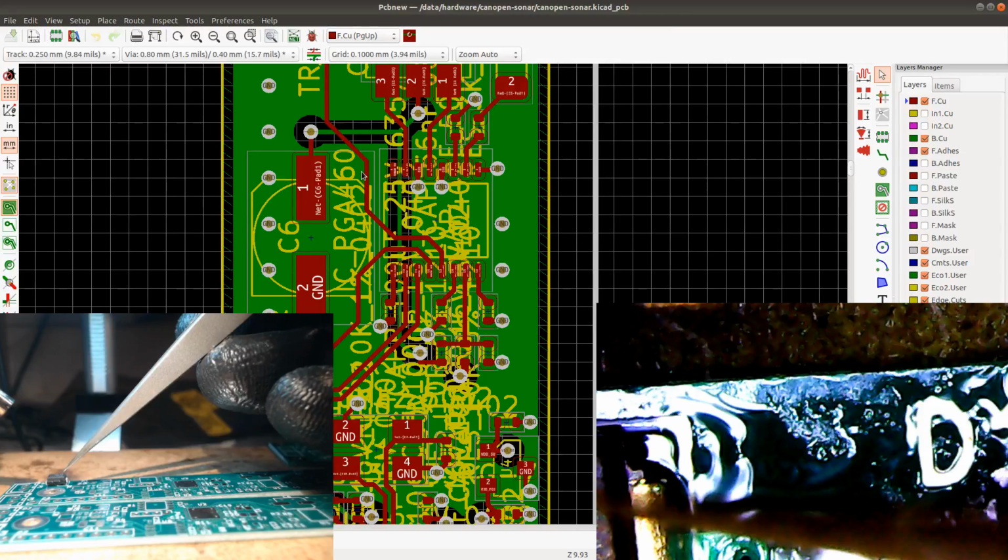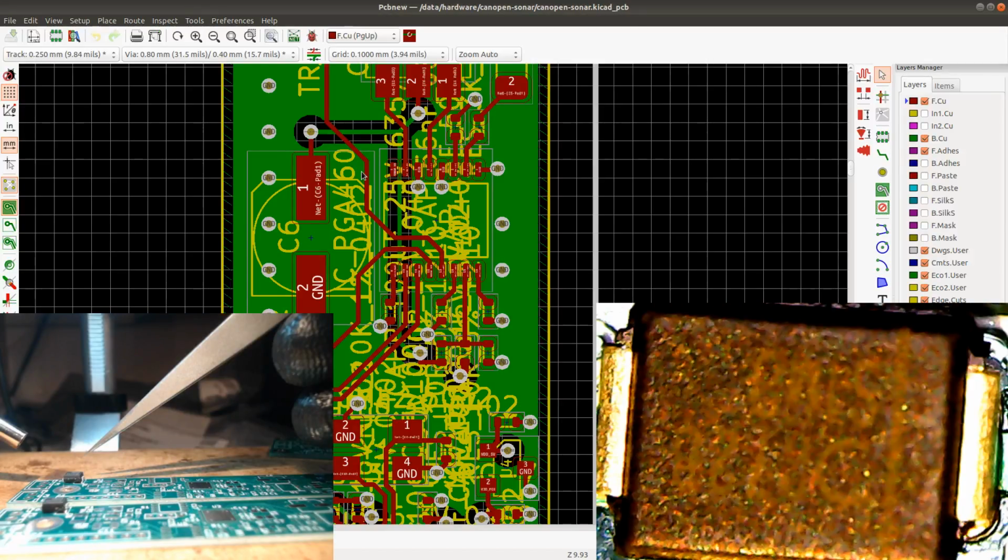Good. Yeah, so then we go to the next component. Let's throw this out. What's next? This is the bag from that one. So we got the diode soldered there. This was a better soldering job than the other one. The other one is a bit off. It's still sitting on though, but let's get it better. Let's get it to sit straight. And I'm gonna lower the airflow.